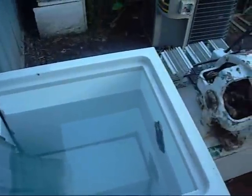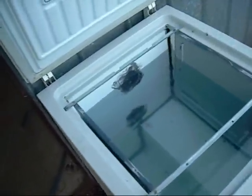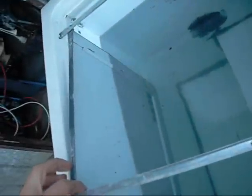As the cathode, like an alligator clip or something on the cathode, stainless is alright because it's being protected, it's being cleaned. But if it's being eroded as an anode, it'll turn into hexavalent chromium and make your solution toxic waste. So stir this up and build an anode assembly and go from there. There's a couple of anodes there. Just use the sides of the old HP Pavilion PC.